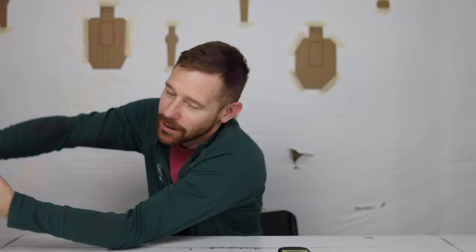And that's because when I was pulling out the safety lever pin, it just went a smidge too far. And then I'm rewatching the install videos and I'm looking up the SIG guy and I'm trying to remember how he finagles the stuff in. And I end up taking apart the whole FCU basically again to get the sear pin out, to line up the sear again. And that sear spring that's in there is a pain to get back in. It's not simple mechanics. You're using tweezers almost, and picks and toothpicks, and just trying to get everything lined up is such a headache.